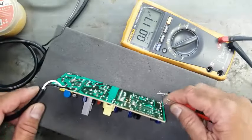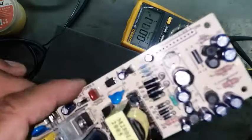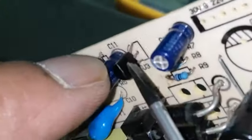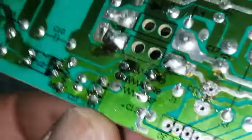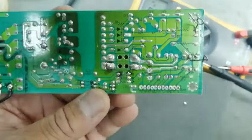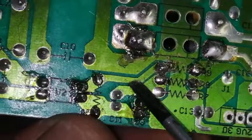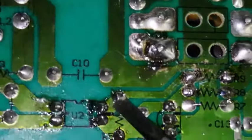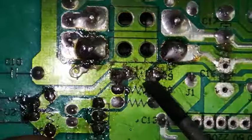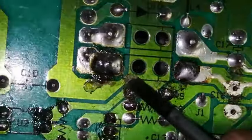First of all, locate the voltage reference. Here is the voltage reference zener. If there is a zener, I will give you a solution on how to deal with a zener. So today I have a voltage reference. This resistor is directly connected to the optocoupler. The one resistor, that's the current limiting resistor, leave this, we have no concern with this resistor.